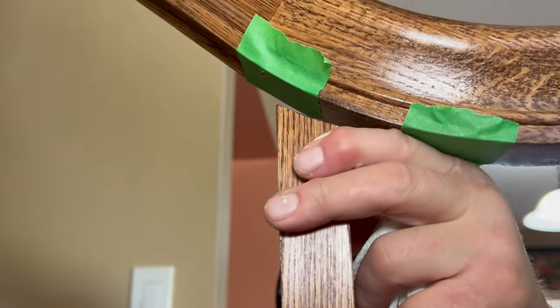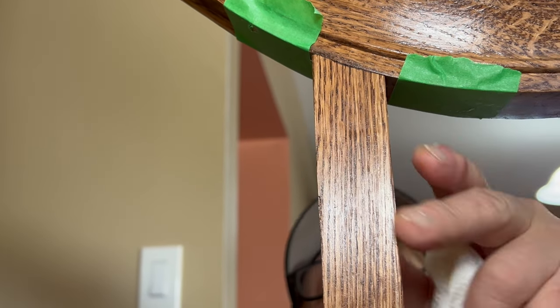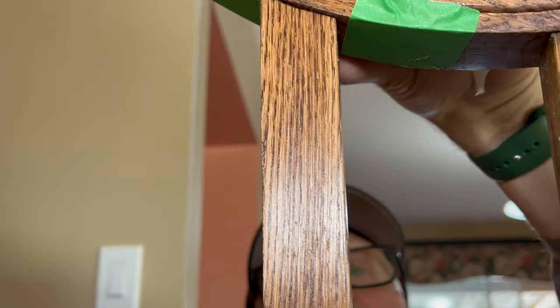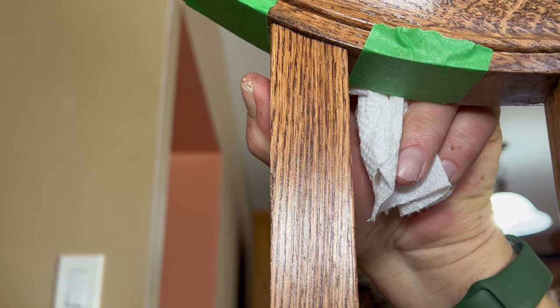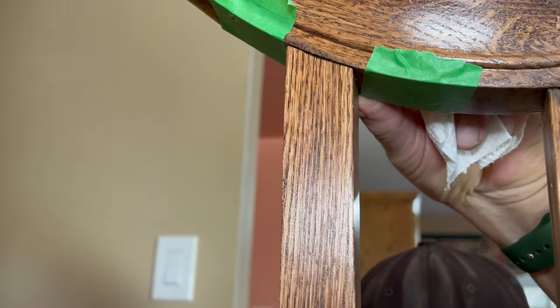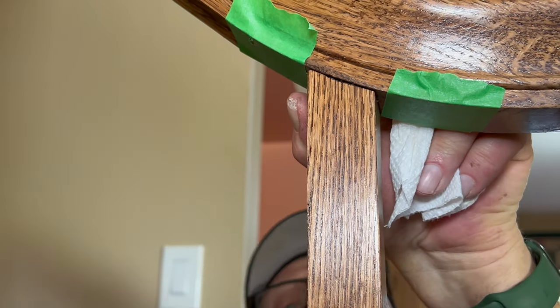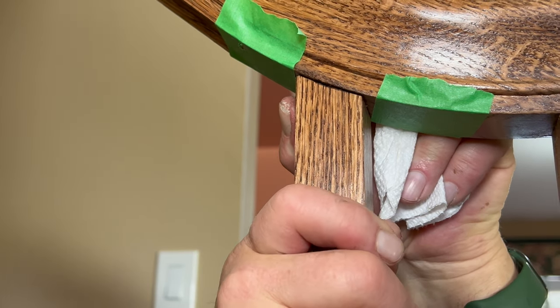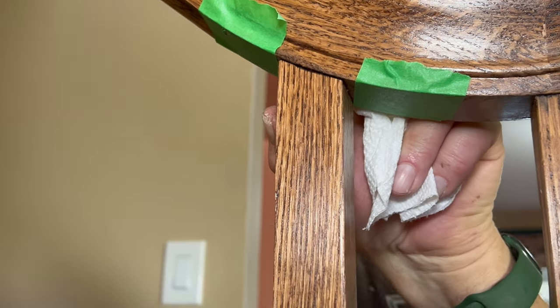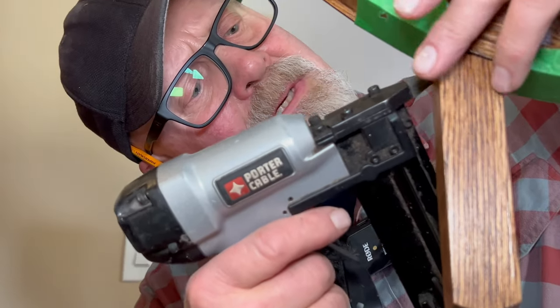All right, so when you put a baluster in with an angle, if you always work this way, you can slide it into the spot, right like that. In this particular baluster, you have no choice on how it's going to go in. It's the only way it's going to go in, just like that. We use a 1-inch pin.